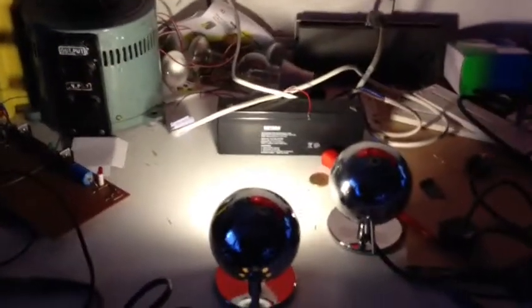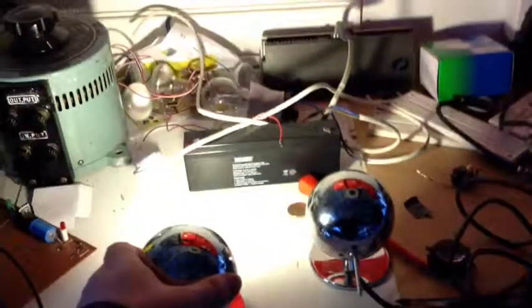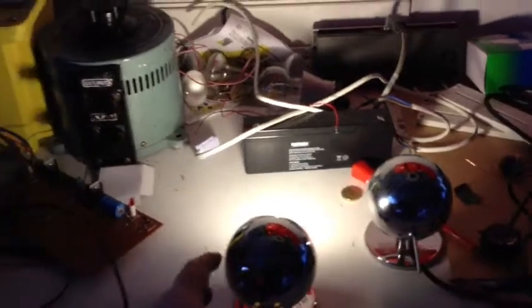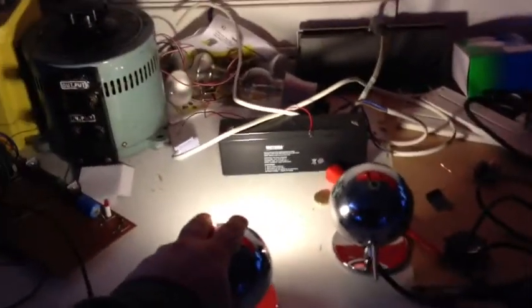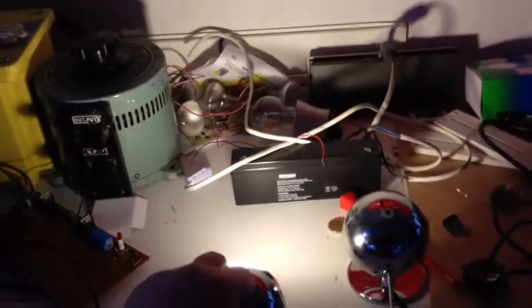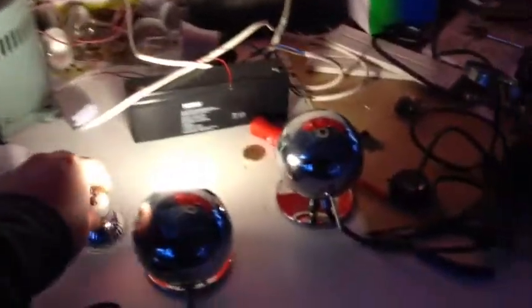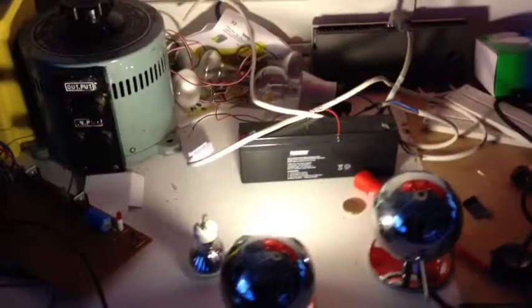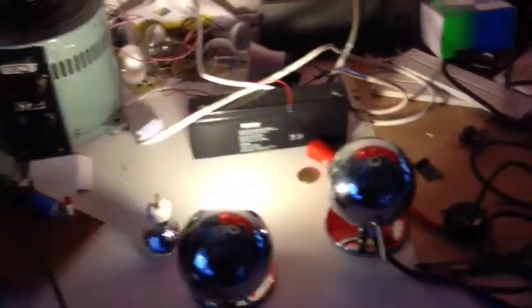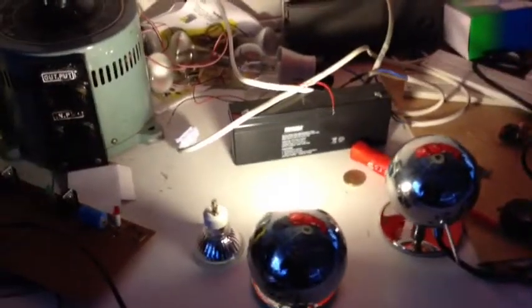You get the obvious energy savings because this is 7 watts. I don't think they're worth avoiding - these are being used in a pub, so they're on all day. The failed one lasted about 14 months at 12 hours of use a day, which falls short of its stated 8,000 hour life - it was about 5,000 hours. But still cheaper than replacing halogen bulbs all the time, because those cost a couple of quid a pop and they were blowing monthly. So not bad - get another year's use out of these and I'll be happy. They actually come with a year's warranty anyway, so I'm happy.